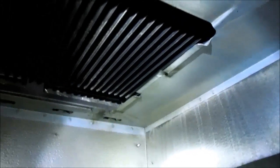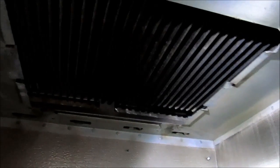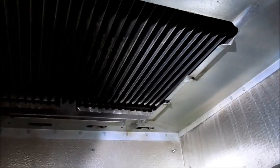That's how you check these heat exchangers: pull the blower out, get to the bottom of the heat exchanger, and if you find any rust at all, poke around with a knife. If it goes through, it's bad — no ifs and buts about it. If you can poke through with a screwdriver or a knife, the metal is beyond the point of being serviceable.